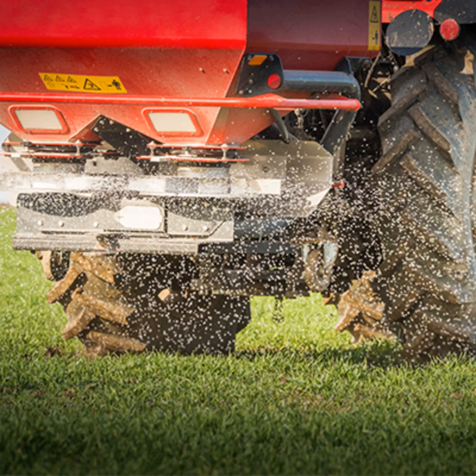With a sprayer you have a big long boom and you can see how close you are to the ground at either side. With the fertilizer spreader you're relying on those two little discs and the six inches of steel to throw the fertilizer out. If you're down a little bit on one side, the effect is huge — you'll be throwing the fertilizer into the ground on one side and up in the air on the other. It might be as simple as adjusting the arms on the tractor or checking tire pressure, which can throw it off too.